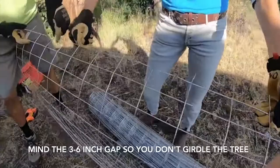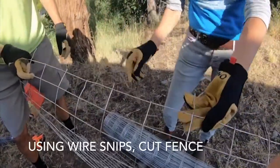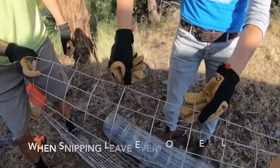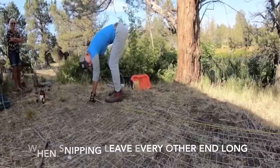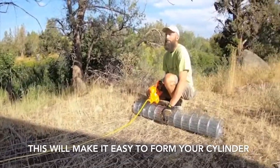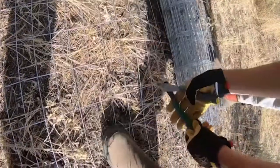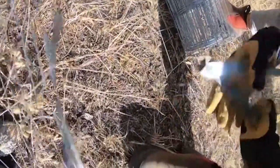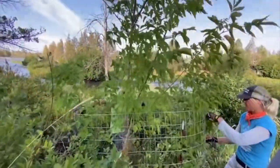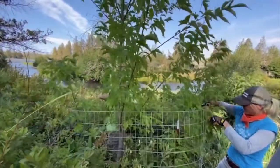The next step is to roll out your cage wire mesh fence. You'll cut every other prong and use those to attach end to end. When you roll it out to your measurement using a tape or even a rope, you'll use wire snips to cut those ends — again every other one — leaving one long end which will attach to the other. We usually use an overlap of two squares.